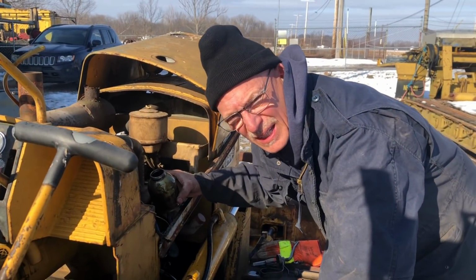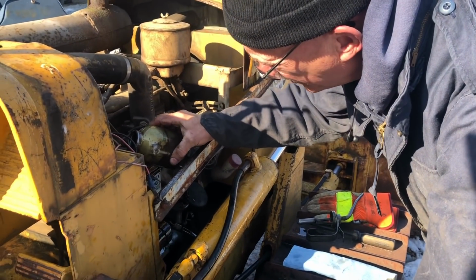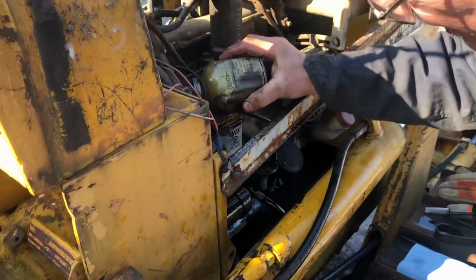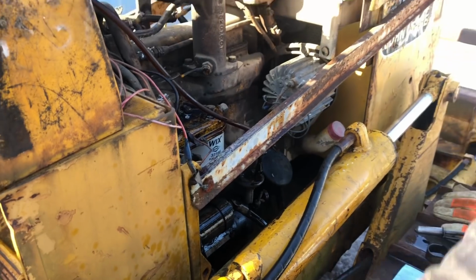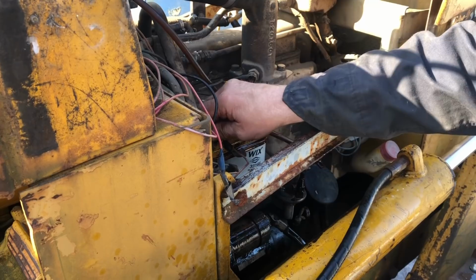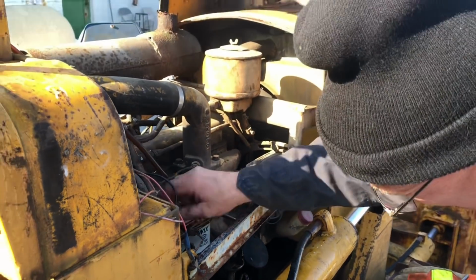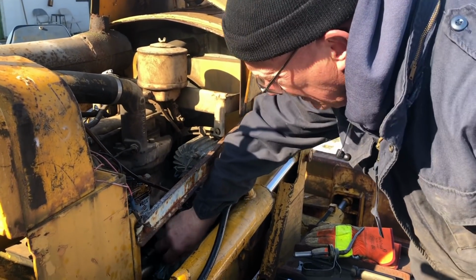So it's a different day, and now we're back with filters. I had to buy a sediment bowl, which was really expensive at the John Deere dealer. What I'm doing now is a pretty sloppy job of filling these filters. Meant to bring an electric fuel pump in case this pump doesn't pick up. But right now both filters are filled, and that will give those two new filters and that pump the best chance to pick up and supply the pressure pump.